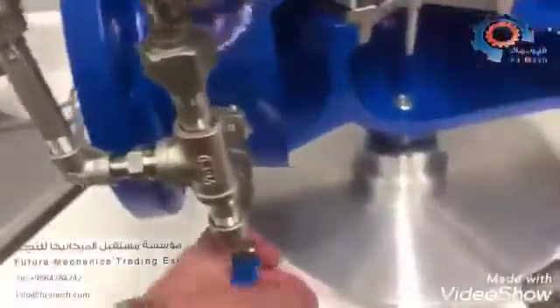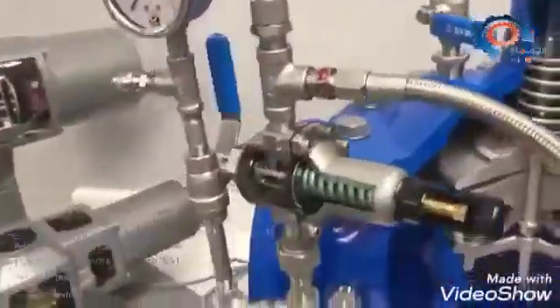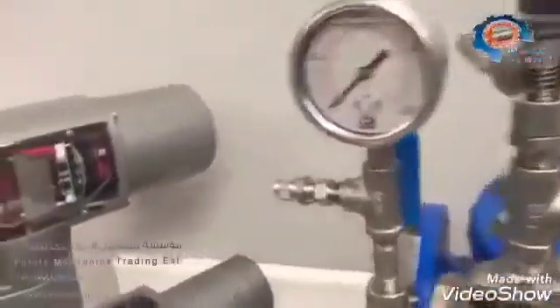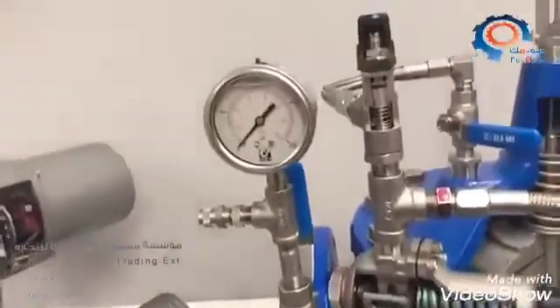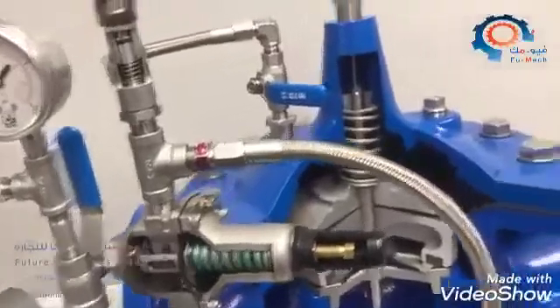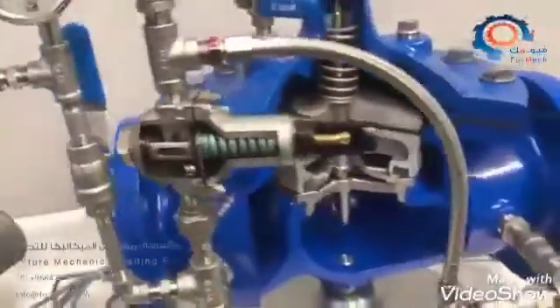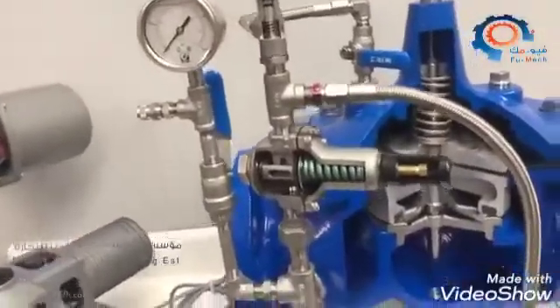When you have the valve locked at the outlet and at the bonnet, you can run flow from the inlet up through the pilot and out the gauge and bleed. This tells you what the downstream pressure of the pilot is — essentially what your pilot is set at. You can set your pilot with water flowing through that bleed without actually manipulating the main valve. So even if you don't have enough demand to operate the main valve, you can still rule out your pilot system and make sure it works.